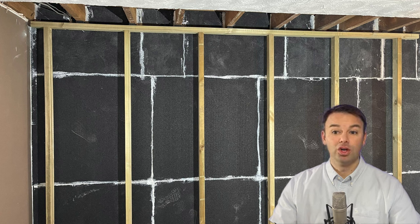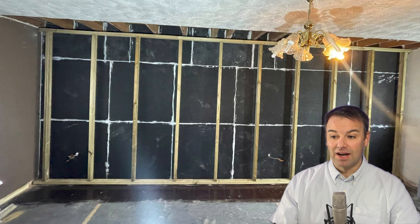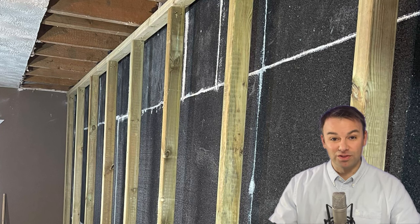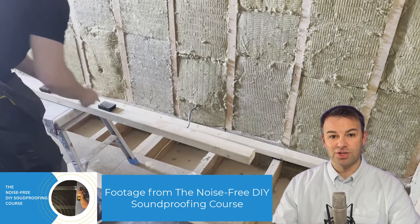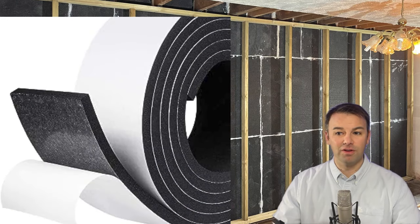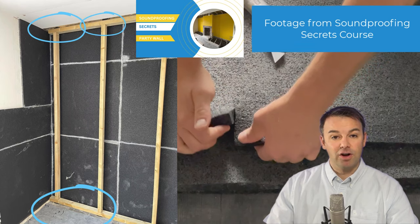What you do next will depend on your skill level, your budget, and your space loss. For this particular system we're going to use a floating frame — and you can see it's not a traditional stud frame. There's no upright stud fixed to the flanking wall; the top plate is isolated from the joists and the bottom plate is isolated from the floor. The anti-vibrational pads we use on the top and bottom plates are the same pads used under industrial machinery to reduce vibration. If you're already sound dampening the wall with 20mm rubber, just use the off-cuts of that rubber as the anti-vibrational pads for your frame.